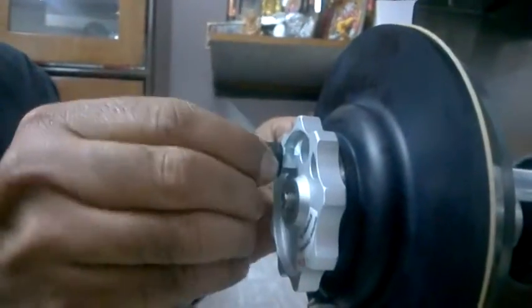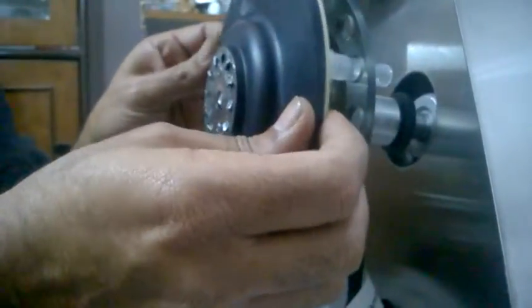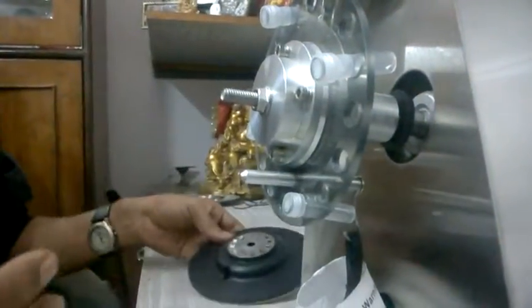If you open the lid, this is your sample area. The black part is called the sample vial holder lid, the aluminium part is called the locking knob, and the black pin is called the locking pin. Pull the pin out and rotate it clockwise or anti-clockwise so it comes slightly out, then move the aluminium knob anti-clockwise to open it and take the black lid out.